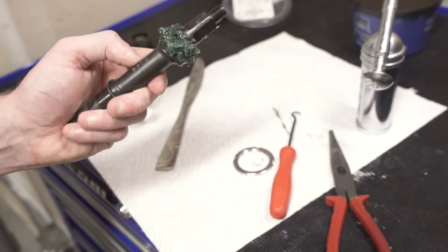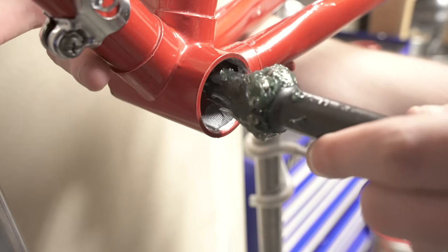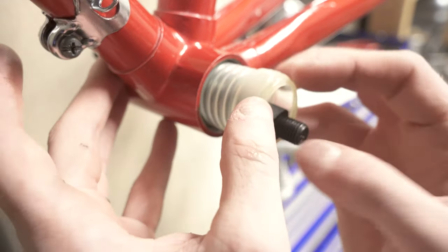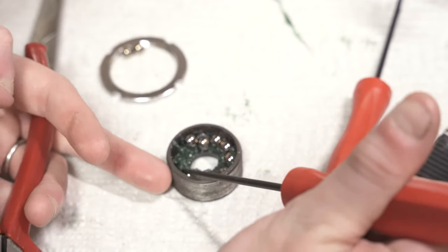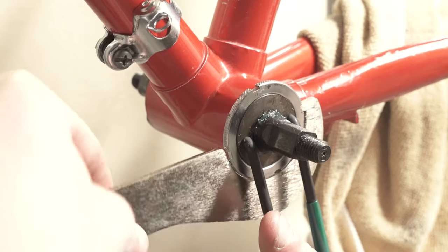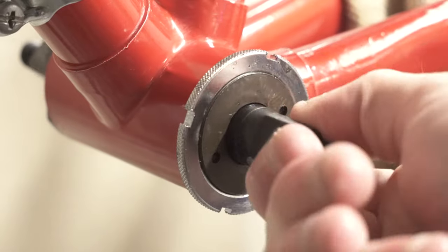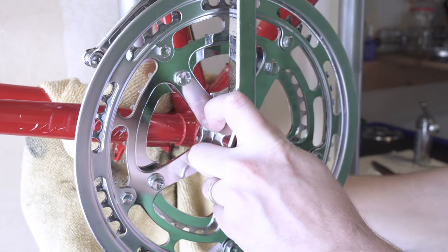Putting the ball bearings on the spindle: put a bunch of grease on there, put your ball bearings on, cover with grease, and push it across. Try carefully not to get grease in the anti-seize — anti-seize has a little more particulate than grease, so you don't really want to mix the two. Now I've got bearings on both sides. Then put the cups in and tighten until you feel good engagement with the bearings, put the lock ring on, and test the spindle — make sure you don't have any play. These are 40 or 50-year-old parts, so you're only going to do so well.